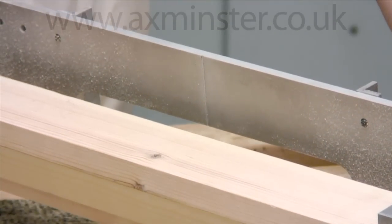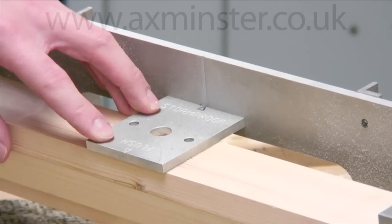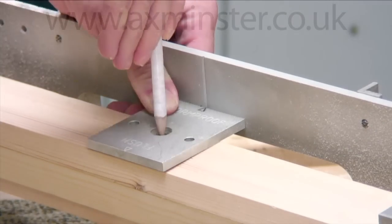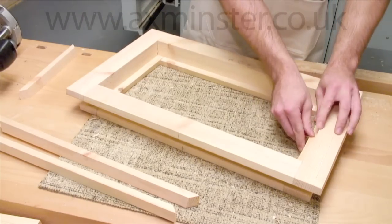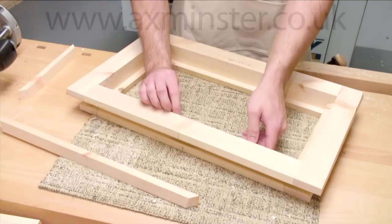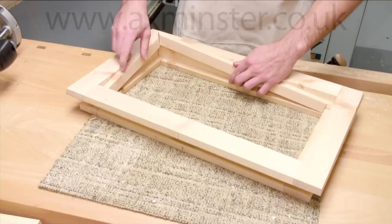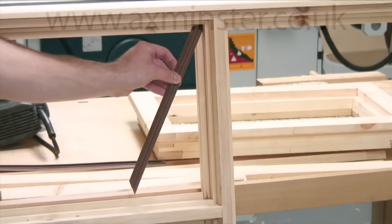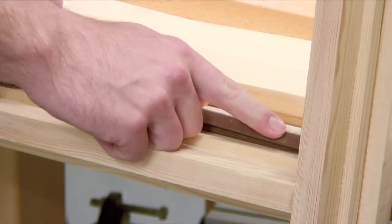When the pocket has been created, before removing the jig, use the supplied template, correctly orientated, to mark the positions of the holes for the securing screws and the lock spindle. The retrieved bead, having been mitered, can now be fitted to the glazing rebates. The profiles in the frame are set to use a 22mm flipper weather seal. Cut the weather seal to the correct lengths, miter the ends and press the seals into the grooves.